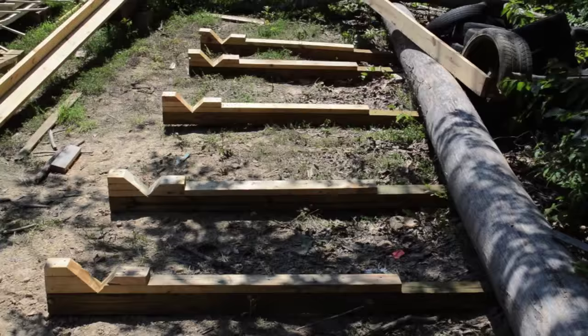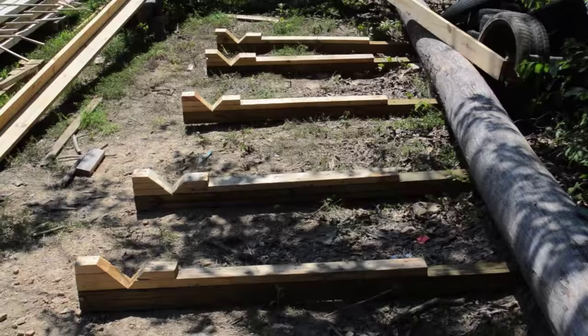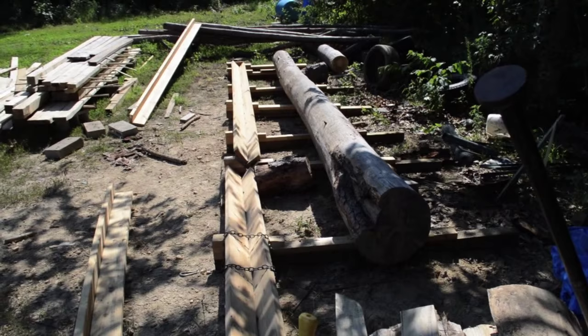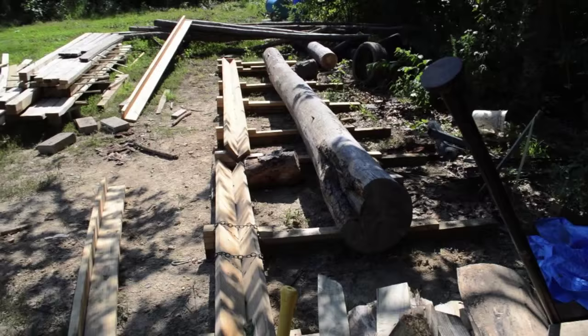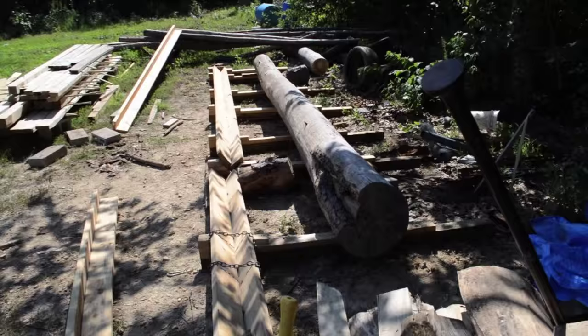I'll show you how to use the sawmill correctly — it's a function of keeping the blade sharp, tension properly set, and letting it cut itself rather than pushing. When it gets hard to cut and you push into it, you make it wavy. I've got the log on the rails and it's pretty much centered up, but I still need to secure it so it doesn't move. When using a bandsaw mill, especially once the log gets lighter, it can catch in the teeth of the blade and shift on you, so you have to secure it.